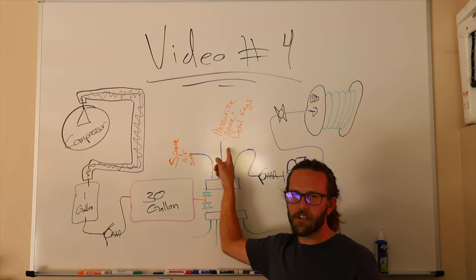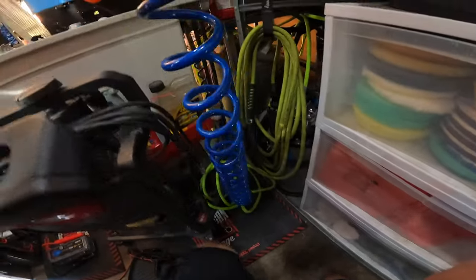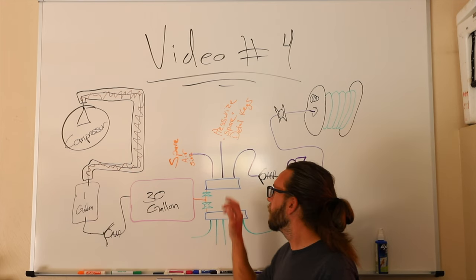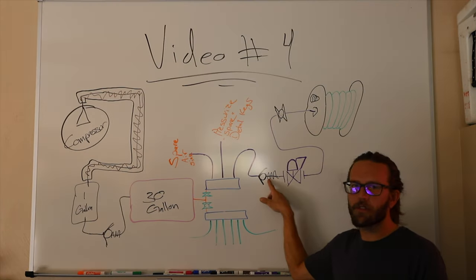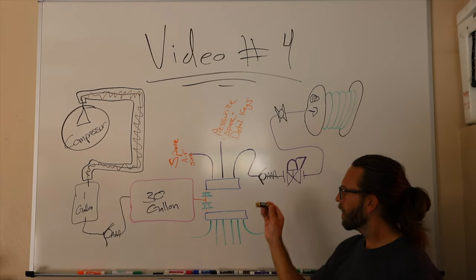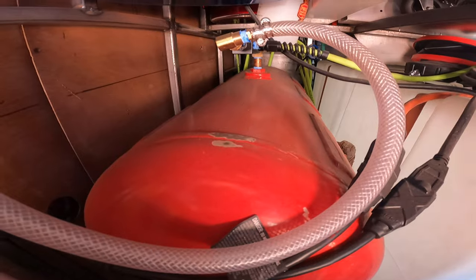Second hose, it's the hose I use to pressurize my, in quotation marks, spare detail kegs. What I mean by that is a detail keg I bring in and I set in the trailer, I'm able to grab that hose quick, unhook it, set off to the side, get the work. Because all my other kegs, I haven't told you yet, but all my other kegs, okay? The third hose, hose number three, goes through a check valve, goes through a regulator. That's the symbol for a regulator, which is the same regulator I'm always bragging about. The coil hose pneumatics regulator. So that's in line there, which goes through another ball valve, which goes to my air reel.